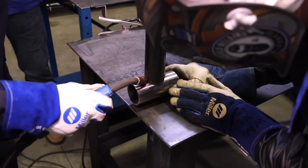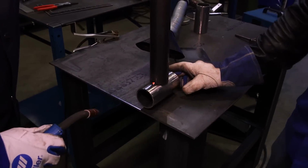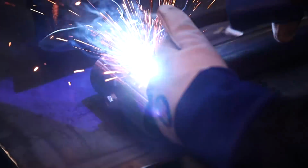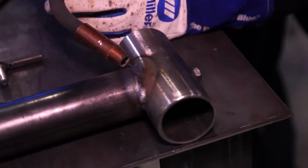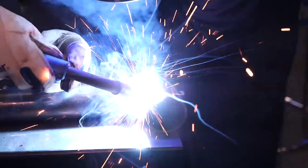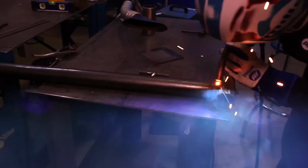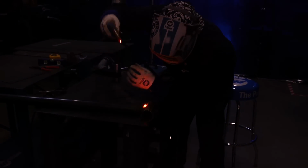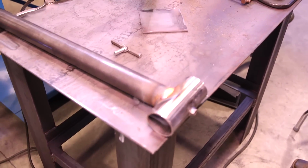All right, guys, these 2 are gonna be putting the saddle on the sleeve. So what actually happened is they saddled this piece of pipe, tied it into the sleeve, so it has a good fit all the way around it. On this piece in particular, make sure you're putting a good weld on it. It's gonna have quite a bit of pressure on it, depending on how big your coupon is on the end of it. So you definitely don't want that breaking. Good looking, that's perfect.